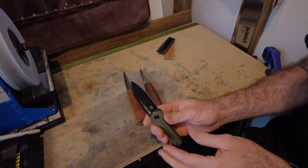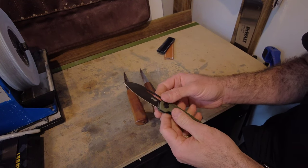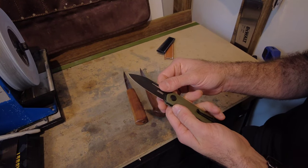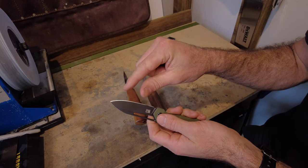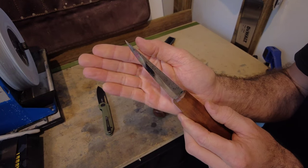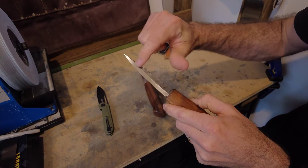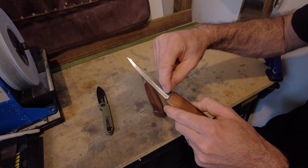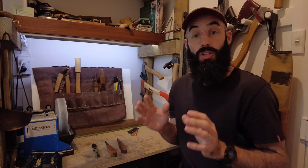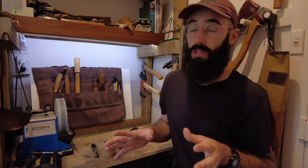That's fantastic for everyday use — that's the reason they are created this way. You can keep them sharp quickly, they do slicing tasks well, and they won't chip or break in the same way. If something does go wrong, you're only having to re-grind the very edge, as opposed to a flat over hollow where you basically need to bring it all the way back to the far bevel and work all the way from there to grind out the chip.